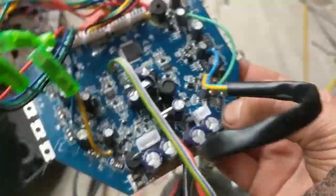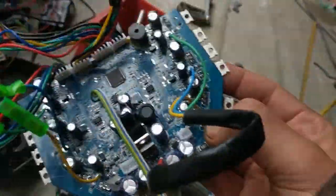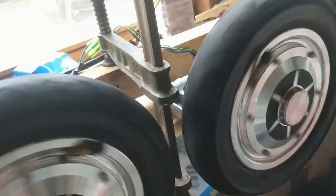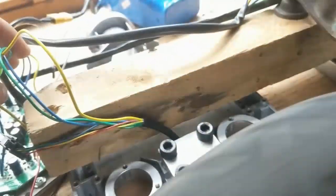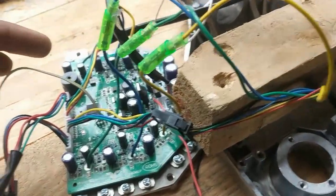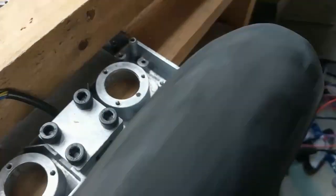I had to unsolder some components and order new ones, but I could program this board and the left side is fully functional. All three phases seem to be okay because when I short two of them I can see torque. The hall sensors also seem to work because otherwise the Emanuel firmware would output an error beeping.